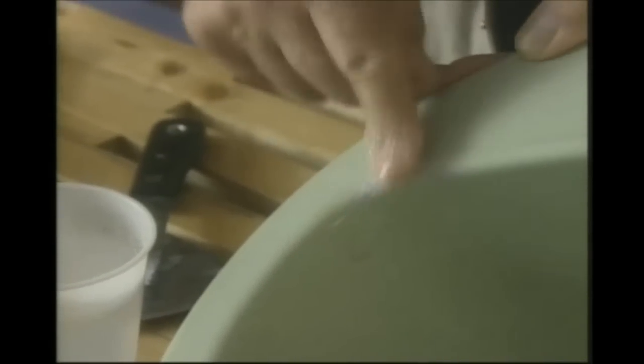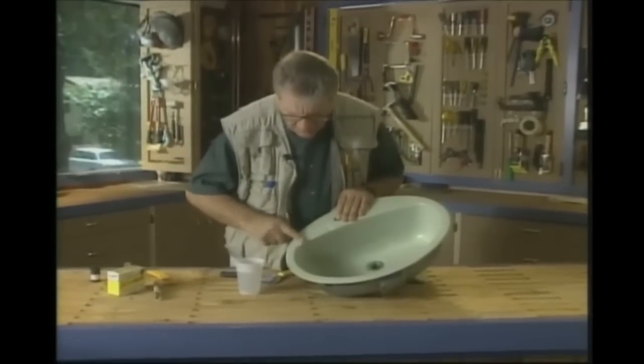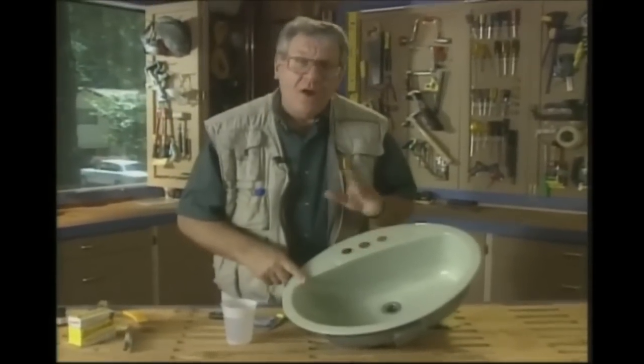You're molding it into the cavity of the chipped porcelain. I've got it almost perfect — the cavity is all filled in and it's nice and smooth. All I'm going to have to do now is some very fine sanding with some emery paper, but first I'm going to let it dry for 15 or 20 minutes to allow the epoxy to harden up.